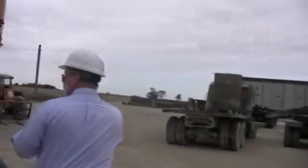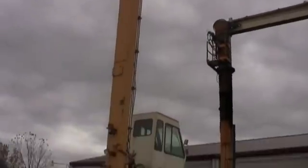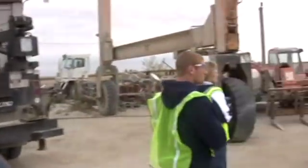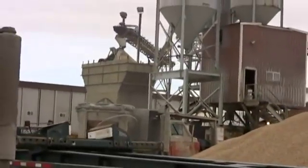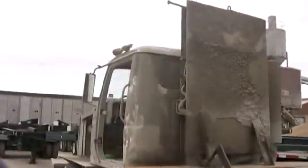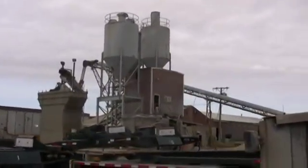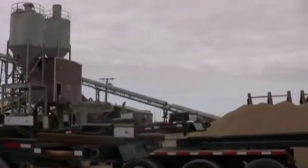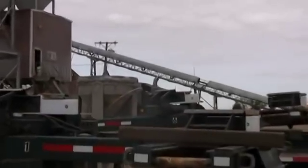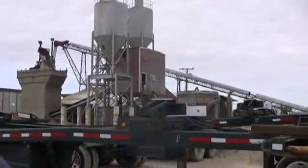There's a gate that opens up on the bottom, and it fills up all these different trucks that we have that deliver them to the pouring beds. And those trucks are still mixing. This is called a pouring truck. You see the bucket on the back over there? That'll hold 2 yards of concrete, and the guy will take the lever that's on the side and pull the lever and open it up, and it'll fill the bed. It'll walk down the line, fill the bed, keep just rocking that thing back and forth. The other truck will come and deliver more. So no pump industry? No.